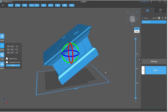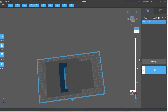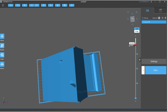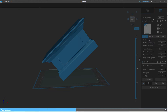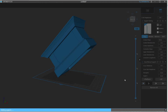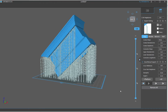You can change the lift speed and the bottom exposure time, but it's going to be a really hard print with that endless tug-of-war happening. So you don't want to print big surface areas in one go. For that reason, I'm going to tilt it over in this sort of direction. When we do the layers on this, looking from the top, we've only got small surface areas each time. The only time we start getting large surface areas is when we've done the full print, but it's not one massive block in one go. I'll then add supports - clicking on supports generates them with a raft to sit on.